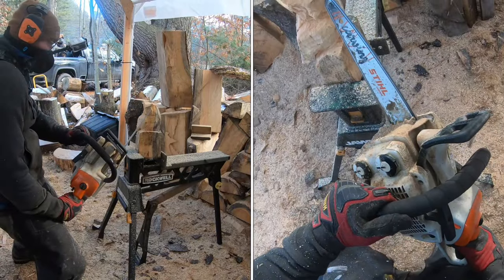As far as the front goes, it's a similar idea but not a diamond look — I want the edges of these to look rounded, overlapping, and kind of fluffy so his chest is sort of puffed out. Notice the bar nose is high, the saw is very low — we're undercutting these feathers, removing material very slightly. This all takes practice, it isn't always a one and done thing. Get a few blocks ready and just spend time practicing. After every three, four, five pieces you'll get more detail and more definition. Also every single piece you do — put your initials in it somewhere, preferably the bottom or the back.